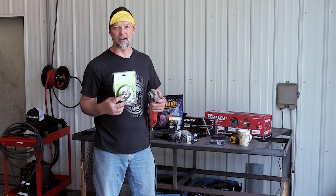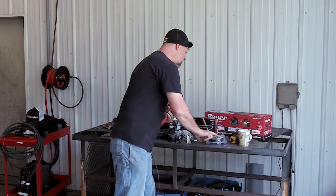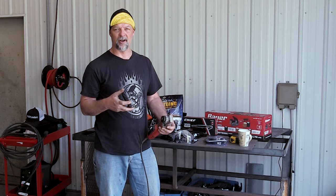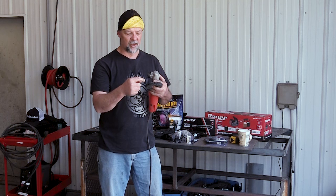To do one complete smoker — equivalent to a 500-gallon tank — it's going to wind up being probably six to ten of these discs. They do work pretty effectively, but the real downside is they tend to gum up. If you get this up against a piece of strap or something sharp welded to the tank, it'll just grind away at the edge and fling stuff everywhere.